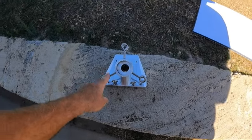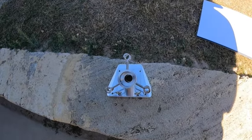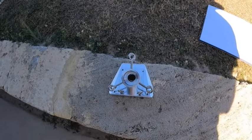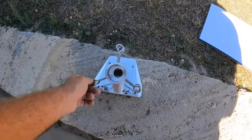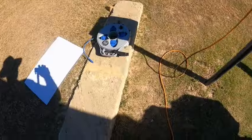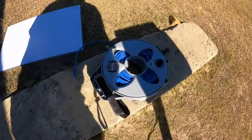A couple of things when this comes from Space Tech: the fasteners are socket head cap screws and allen-headed grub screws, which is a bit of a pain having to get an allen key out all the time. So I went to Bunnings and bought these M6 stainless eye bolts — basically it now becomes a thumb screw so you can screw it in and out by hand.